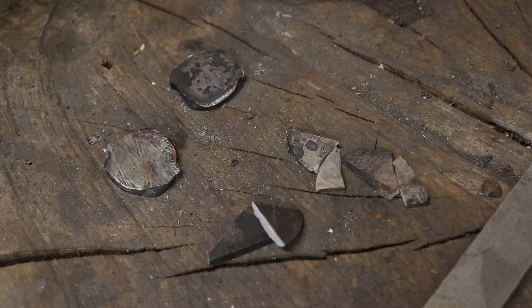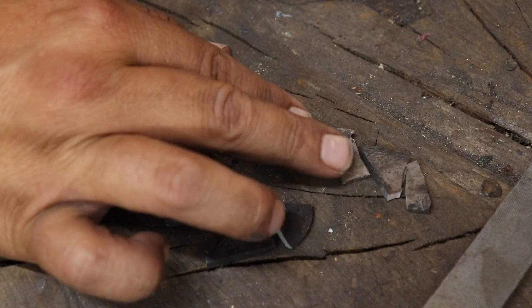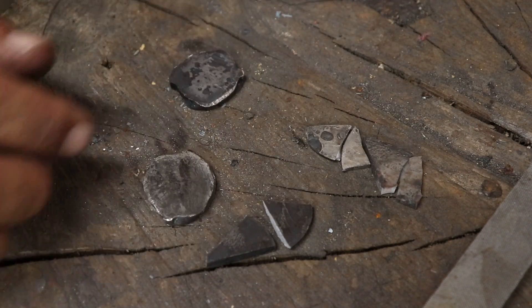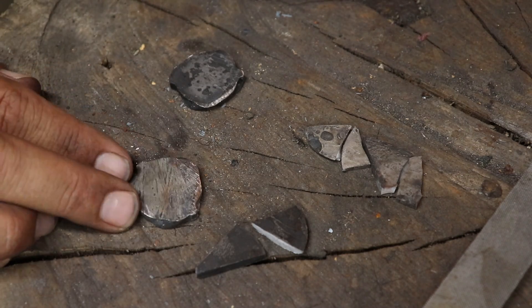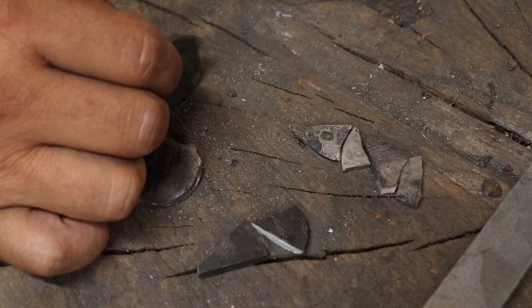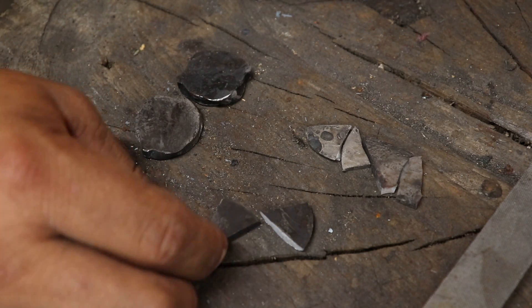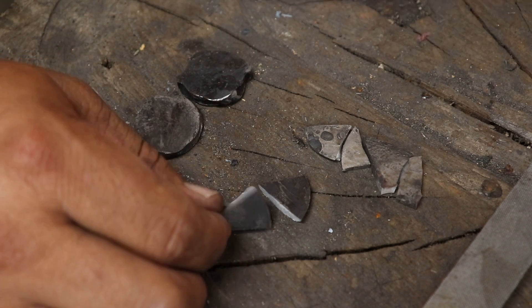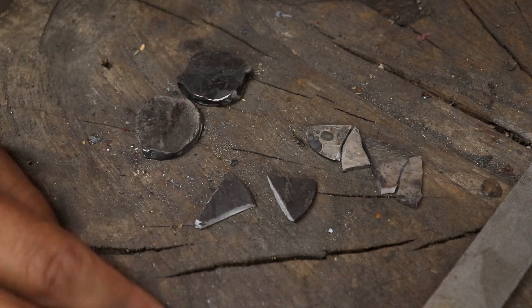Overall I'm pretty happy with the test. I think I learned quite a bit from that — stay away from water on the inch and five-eighths. The one-inch material really doesn't matter; I can probably run it in water if I want to stiffen it up some. But the inch-and-five-eighths — I'm going to try to make some top fullers out of it eventually since it's pretty good material, and once I temper these it will be a lot better. As always, I appreciate you watching. I hope you enjoyed the video. I'll see you next week.